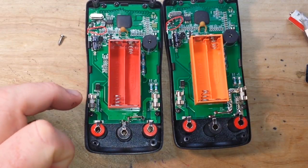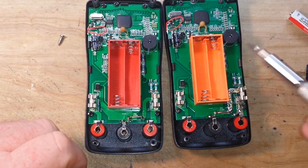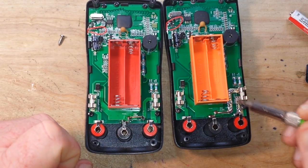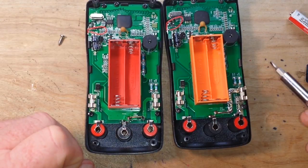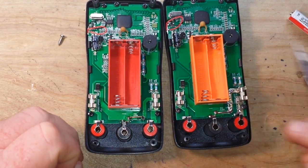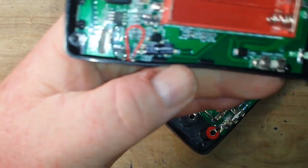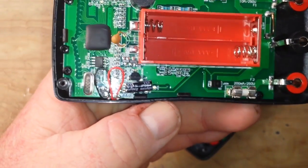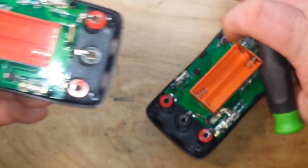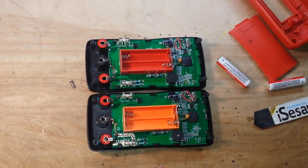So, both boards are rocking the glob top — that's the chip encased in resin. Now on the new board, look where they've added the copper traces here. On the input protection side there's a heavy regular trace, but no extra protection. Diodes are on the same spot. Resistors — on the old board, can't tell if these are resistors or capacitors. Looks like both, but on the new board those parts are not there. So that's what we're doing — comparing and contrasting.